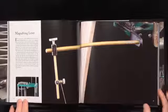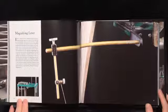This magnifying lever amplifies the motion from the summing lever. It's a simple brass rod with a threaded end. It can be unscrewed from the angled bracket that attaches it to the summing lever. When we brought the machine to our shop, it didn't have a writing mechanism, and so I took data by hand. I would measure with a ruler the motions of the tip of this arm and then plot its position against the number of cranks.